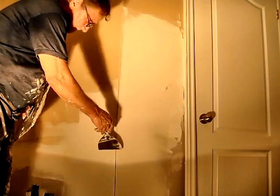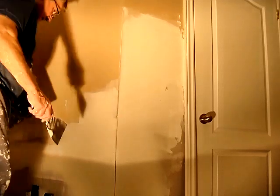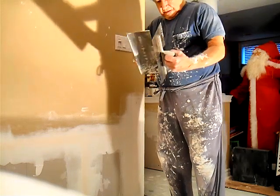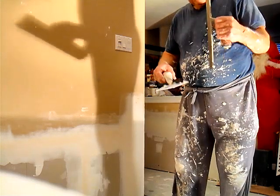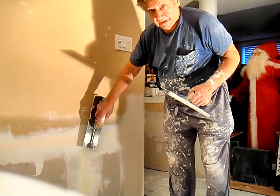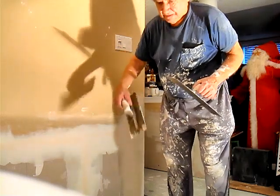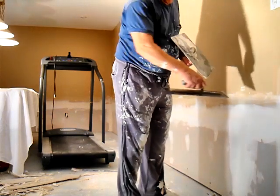Under a 30 degree angle, quarter bead. They call it a splay bead. Splay quarter. Two trowels, approximately the same length, but this one has a red handle, which indicates that it's slightly concave for doing butt joints. It leaves bigger film mud in the center of the joint. Not too much, but just enough to help cover the tape. This is for corner beads. Just a straight trowel. Red handled trowel, slightly concaved, butt joints.